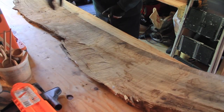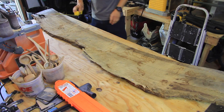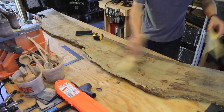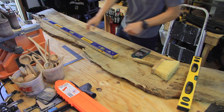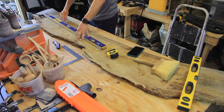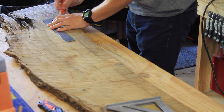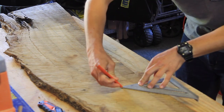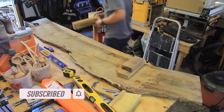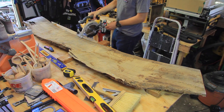Once I had the measurements written down, I went ahead and took one half section of the slab that will actually end up being the entire frame — which is awesome because I'll be able to use the other section for something else. I used a straight edge to pencil in one of the flat edges that would be on the inside of the frame, drew the line in terms of the inside length, then drew a couple of 45-degree angles to get the overall length so I could use my circular saw to break it down. I made sure to use a couple pieces of scrap wood to lift the slab so I wouldn't cut into my bench.